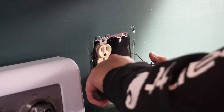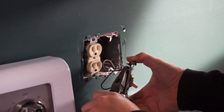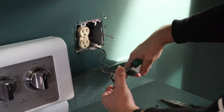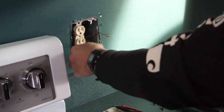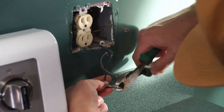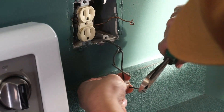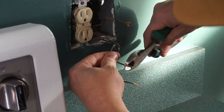With this switch, the electricians straightened the wires, stripped them, and pushed them in the back. There's a small tool you can buy — it looks kind of like a jeweler's flathead screwdriver — that you can push in the back to pop those out. I always just cut them and re-strip them, which is what I'm doing right here.